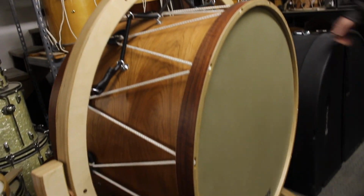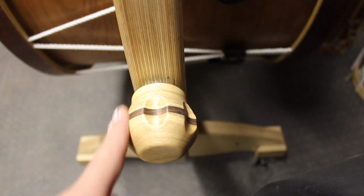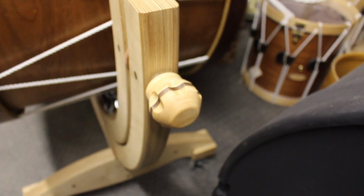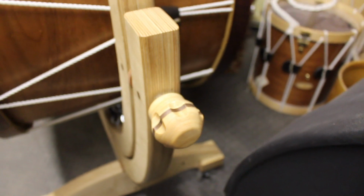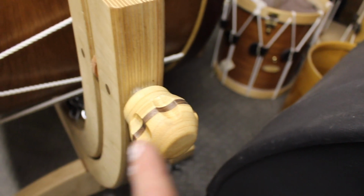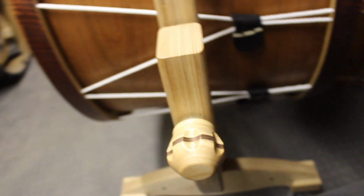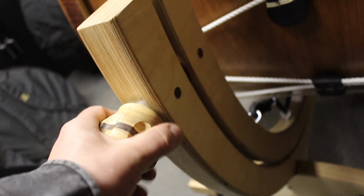So, see my handle design I settled on over here? Oh, how'd you do the scallops? On the mill, I put this in a spindexer and put it on the milling machine, and then just ran across with a ball nose and milled 60 degrees apart. Fancy. Feels good.